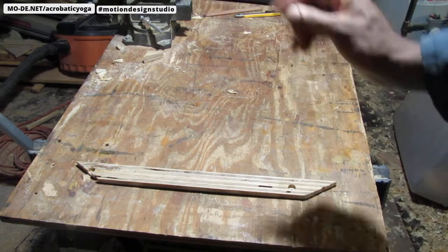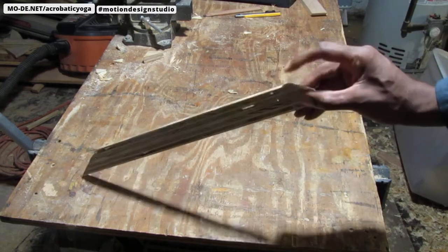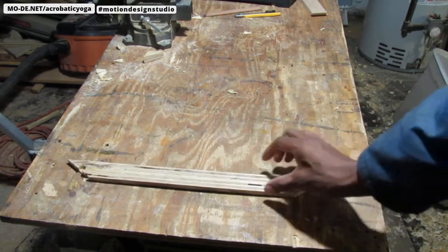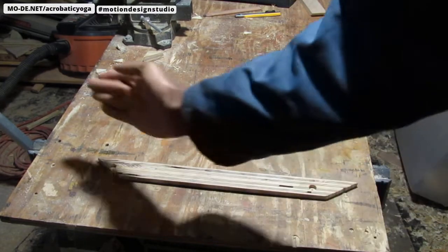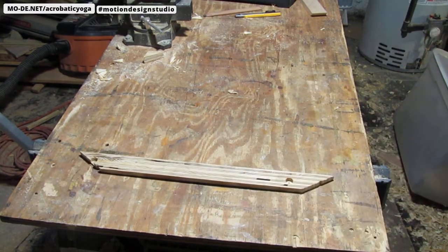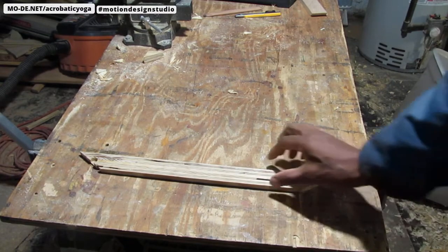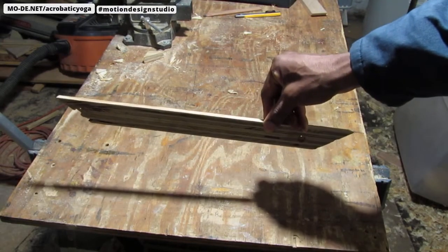on the legs. You take a piece of wood like this, right? This is, it's really thin, nothing too special. It's just a scrap piece of wood. You put it in between the triangles of the legs, and you cut. Just keep cutting the sides, just a little bit each time with your double bevel sliding compound saw, right? Until you end up getting a nice flat fit like that.